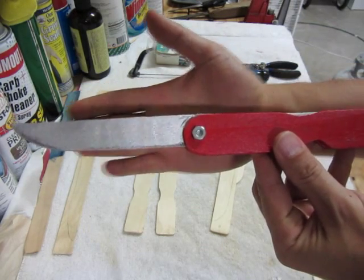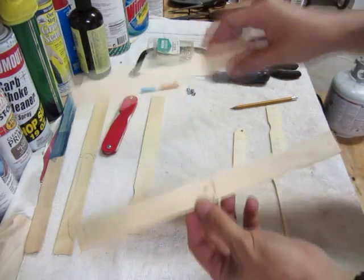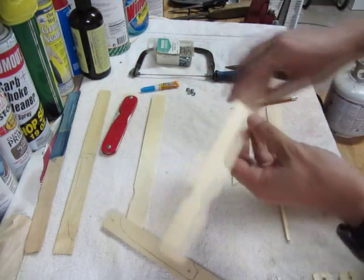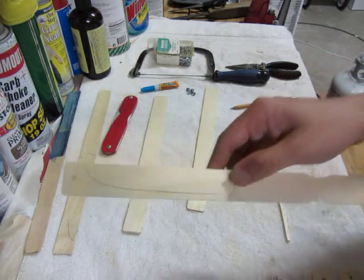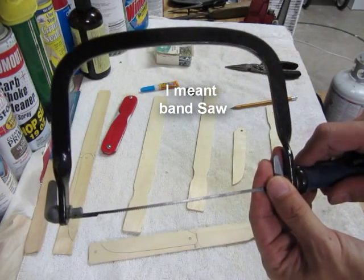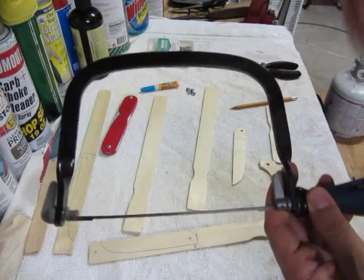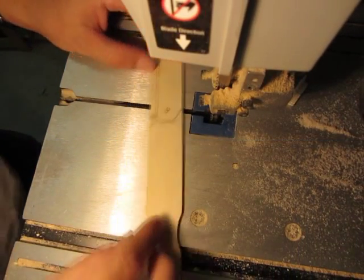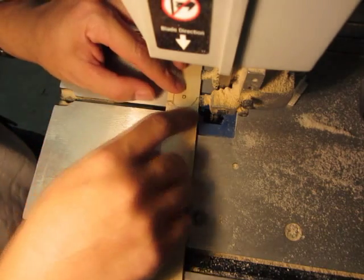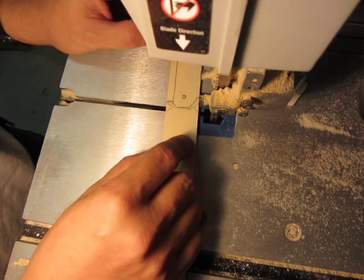Now that the pattern is laid out, don't forget you need another stick for the outer cover piece with the groove portion. I'm moving to the bandsaw, but you can use a coping saw if you don't have access to one — it just takes a little longer. I'll cut the handle or outside cover part first, trim around the edges, and then cut the blade off.